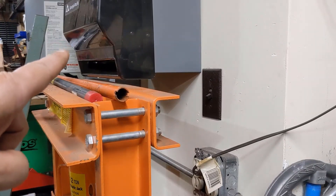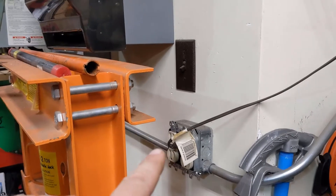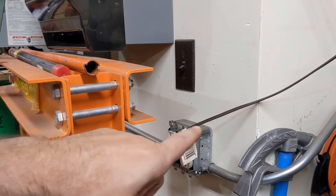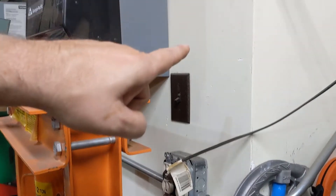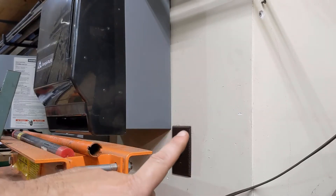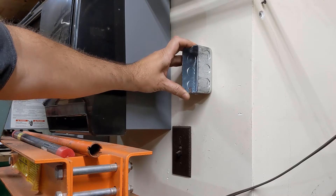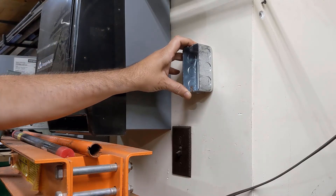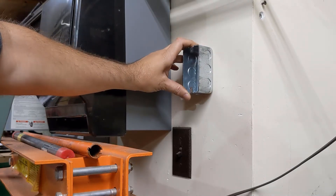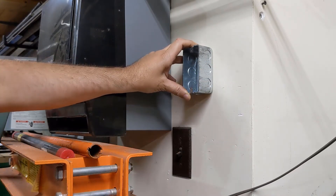The plan is to come from the box, which is right over there. We'll just run the wires down through that piece of conduit. And I'll take another piece of conduit, come up beside this light switch — that's just for a crawl space up above us here — and then I'll put this box probably somewhere right about here. First order of business: get this mounted with some conduit down to this box so we can pull wire.